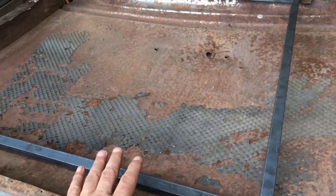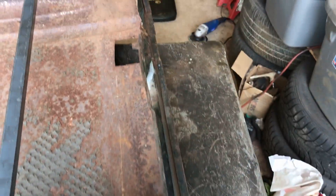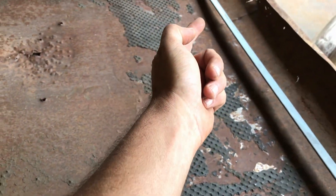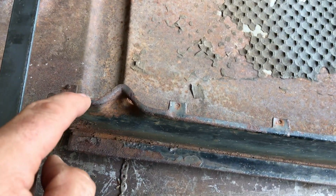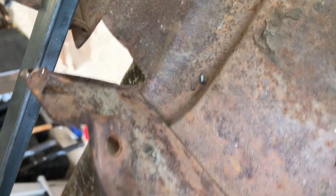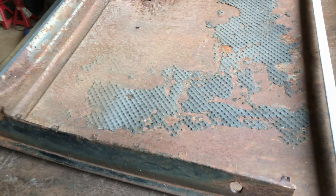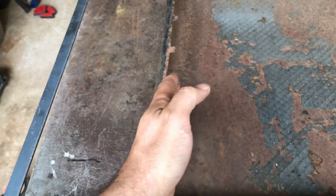Right, the frame size is actually pretty good. However, I do need to just get rid of all these little tabs — I'm not going to be using them anyway, so I might as well just cut all of them off. There's a bit around the other side. This section here, which used to have — back in the day — a threaded rod going to that corner to basically tighten up the whole thing, but I'm not going to need that because the whole structure is going to be solid. So I just need to trim that off there. It's a wee bit fiddly because it's actually a tab that's welded on on the inside. I'll chop that off, chop all these tabs off and then see if this frame slips in.